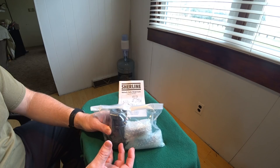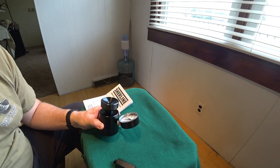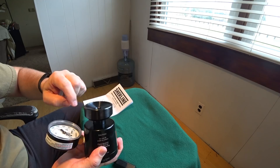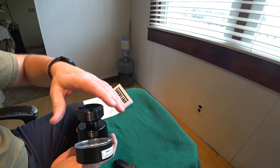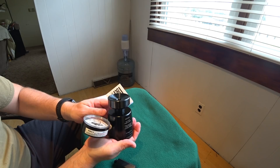There's a word of caution when getting it out of the package — definitely pay attention to this. Do not lift the scale by the piston. This is the piston assembly right here: the threaded cup and the actual piston that goes down into the body. If you lift it by the piston, it's going to displace the fluid and you could possibly pull it completely out. Also, it says place squarely under load for accurate reading, which makes sense — even the slightest angle will prevent it from pushing straight down, so the piston reads correctly.